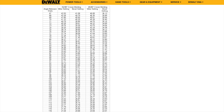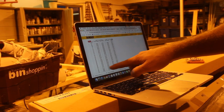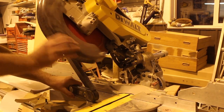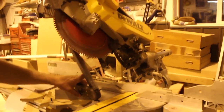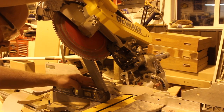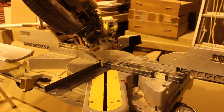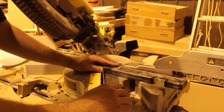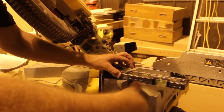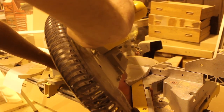For our case it was a perfect 90 degrees, so we'll use that for our example. Here is Russell looking up the angle measurements for our piece, which is a 45-degree molding and a 90-degree wall angle. First, he adjusted the bevel angle to a perfect 30 degrees. Since our miter saw doesn't show this easily, he used a digital angle measure to find the exact angle. With the compound flat method, once this bevel is set, he shouldn't have to set it again. Next he adjusted the miter angle, and even though the saw does show the miter angle, he used his digital measuring tool to make sure the number was accurate. A few millimeters or a slight angle off can really make a difference in how perfectly your crown molding goes up. After that, he made sure he had the right side of his molding against the fence, then made his cut.